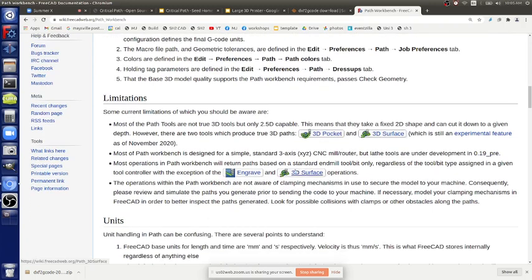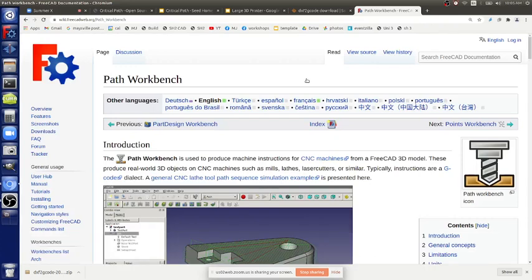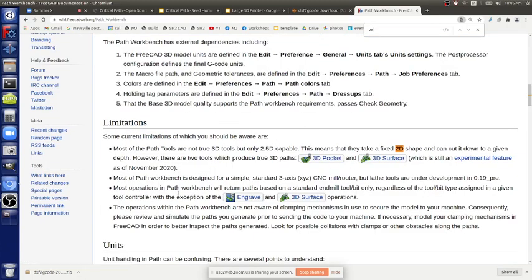But I want to minimize the learning curve. Maybe I'll look up what's the simplest. I think finding the accepted G-code is probably the simplest, because this has a little bit of learning curve to it. Ironically, maybe they do the 3D G-code, and we need 2D in a sense, so I'm not sure. But they do have that because they do 2D CNC. They're 2.5D, which means they're just your XY plus the head moving up and down.